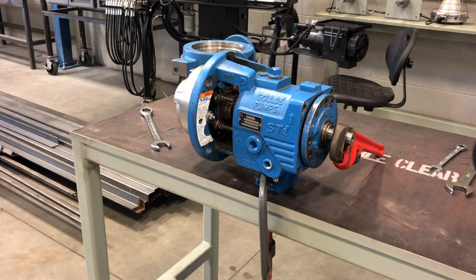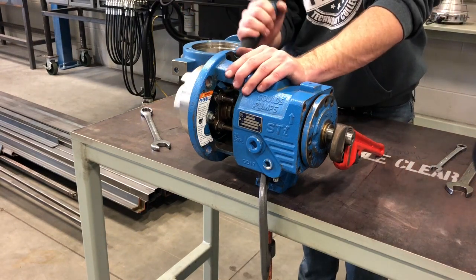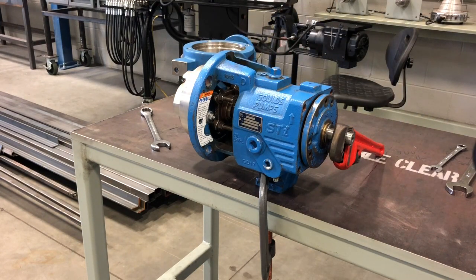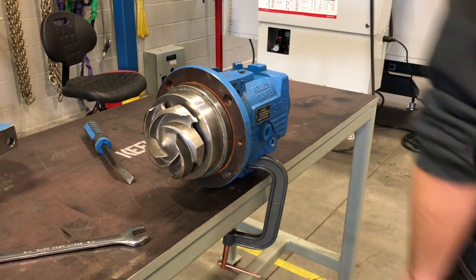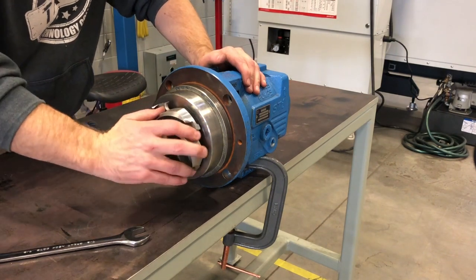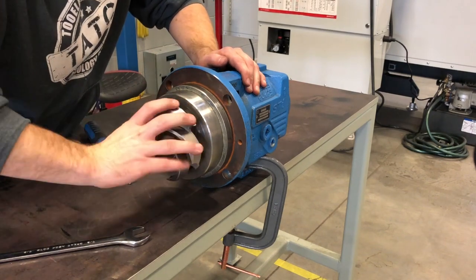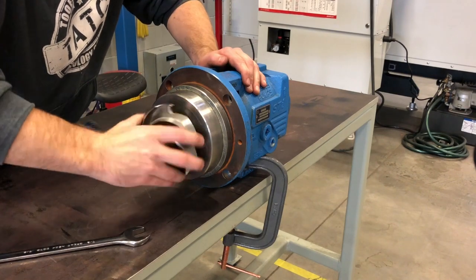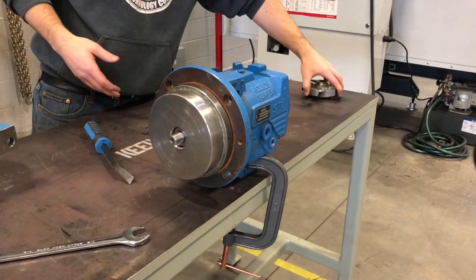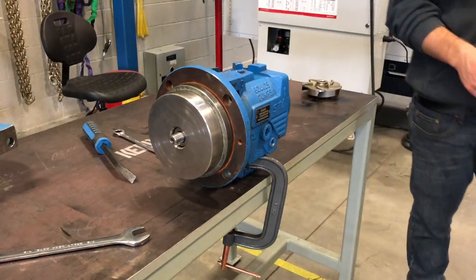In this part I'm going to go ahead and break the impeller loose. What I've done is I've taken a pipe wrench and clamped it onto the input shaft of this pump. I'd rather not see you use a pipe wrench, but right now that's all we have — I'm working on getting a better tool built to save that input shaft. Just be very careful with it. All I did is take a pry bar, get it in between the impeller, and just break it loose. Then I'm going to flip it around and take it off by hand the rest of the way.